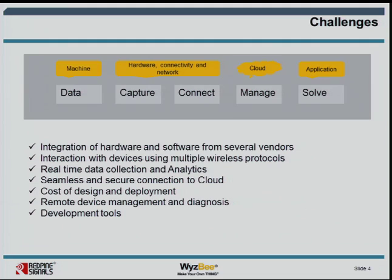We would love to work with only Wi-Fi, and I think it will converge at some time, but today you do have a need for a particular legacy equipment with a ZigBee protocol, and we need to communicate with that. And something else, we would be using a Bluetooth LE to take a health monitoring device, or a Bluetooth for a regular smartphone. Wi-Fi will always be there for the network. Later on, I have a slide to show a generic use case scenario where multiple wireless protocols are needed. It's not something that we should trivialize.